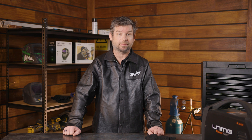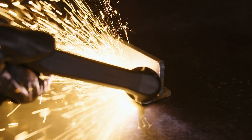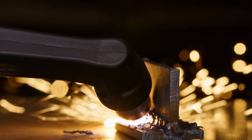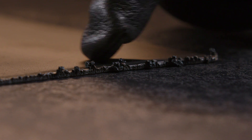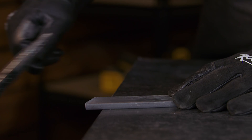If you're just starting from an outer edge, you can start at 90 degrees. If you're gouging instead of cutting, the process is almost the same. You'll still run your torch along the line, but rather than holding it straight up and down, keep it roughly at a 45 degree angle from the metal, as though you're pushing a MIG torch. This helps to avoid going through the piece, because you just want to remove the defective weld. Even if you have the right travel speed, which corresponds with the amps and air pressure, plasma cutting will leave a bit of dross on the bottom. This can be removed with a chipping hammer – it's generally not too thick, so it's easy to clean up.